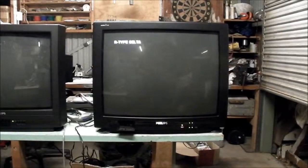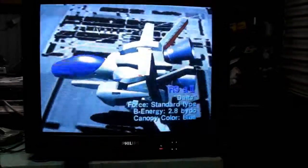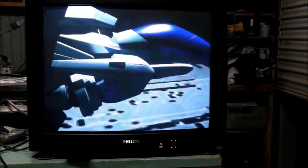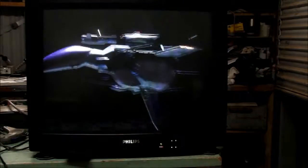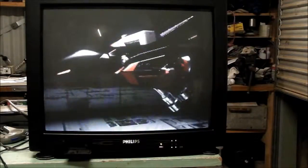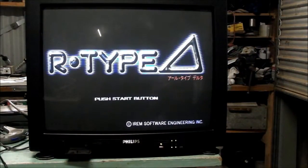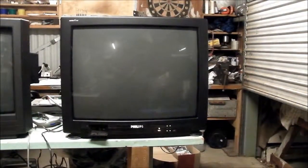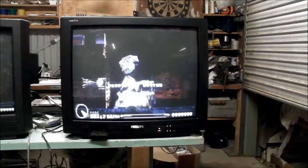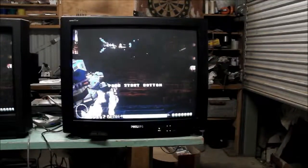At the end of the day, the new Philips here has a decent picture, but not outstanding. You'd probably be better off with a Sony PVM, a Loewe, a Grundig, or similar. The NTSC-to-PAL switching requirement really annoys me, the incompatibility with NTSC S-video is frustrating, and the service menu is a pain to access. A few marks against its name. I've never seen this model before, which is why I snapped it up, but I can't give it a strong recommendation. Anyway, that's another one to cross off the list — thanks for watching and I'll see you next time.